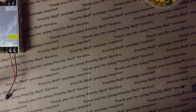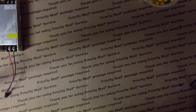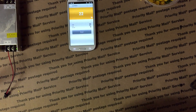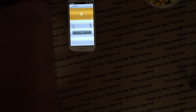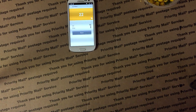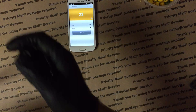I've actually grown with the 5630 LEDs last year and they worked fine, but they're older. Newer models like the 2835 are supposed to be more efficient, so we want to see which is the brightest. We're using the same power supply, same cords, same setup, and the same length of strip — about 10 inches — for everything, so it gives us a good sample.